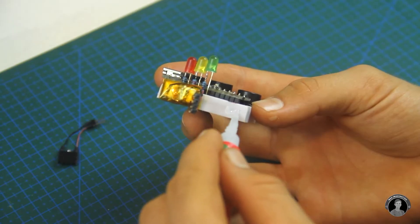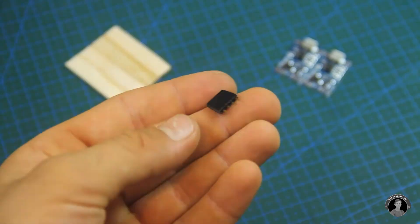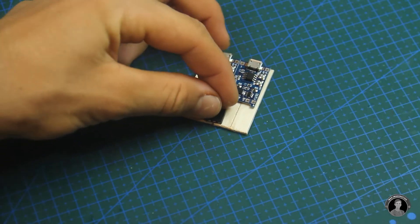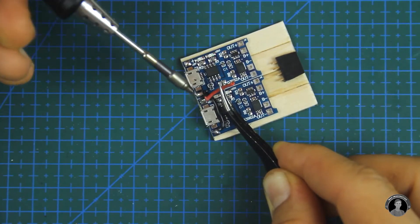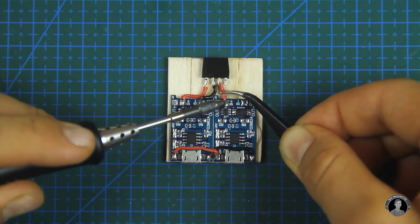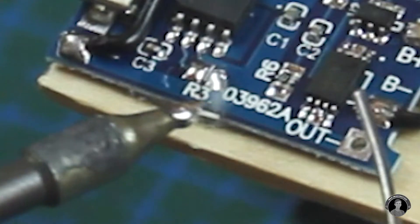If you're feeling a bit lost with the electronics, you may want to refer to the diagram — I've also left a download link in the description. With a small popsicle stick base, a similar female pin header as used before, and a couple of TP4056 single-cell charging boards, we can form the charging unit for the musical device. We'll start by connecting the chargers' 5-volt inputs in parallel so that both boards get powered from plugging in only one USB power source. At the outputs, we'll hook up the battery connections straight to the female pin header. As these boards output 1 amp of current — too much for the tiny batteries — let's swap the current programming resistors with 20k ohm resistors, leaving about 60 milliamps of output current, which is almost perfect.